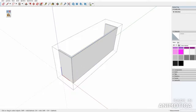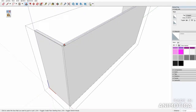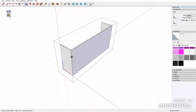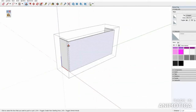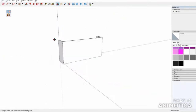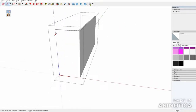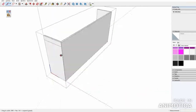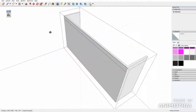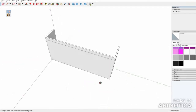I'm going to be adding a chair rail to this. One thing about a chair rail is you want to have equal reveals to your stiles and rails, despite the projection of the chair rail, right? So here we have 2 1/4 inch thick chair rail, so I space it up 2 1/4, and that gives me some space to work with. So let's go down 2 1/4 now. Because eventually I'm going to use the follow me tool, and we're going to pull that chair rail all the way around, and this little baseline here will give me a good line to follow for that.